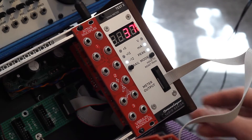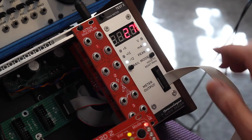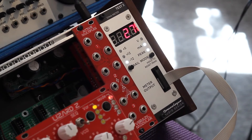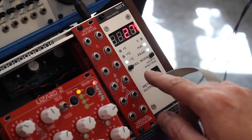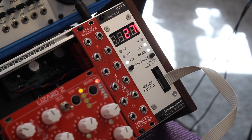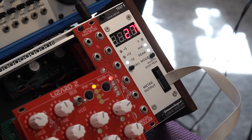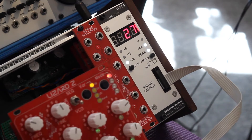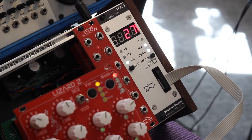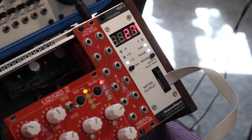Let's put in the cable, plug that in, and reset that peak. On the minus 12 rail, it makes sense that the negative rail isn't drawing much because, as a digital module, it's probably going to take most current from the positive rail — that's what's feeding the microprocessor. The negative rail is only going to be used pretty much in the op amps that are conditioning inputs and outputs.